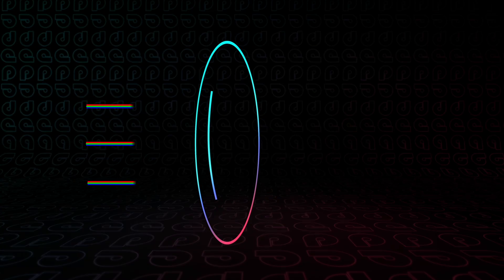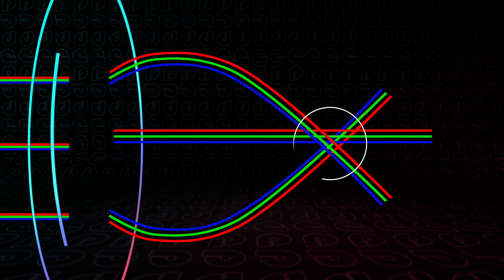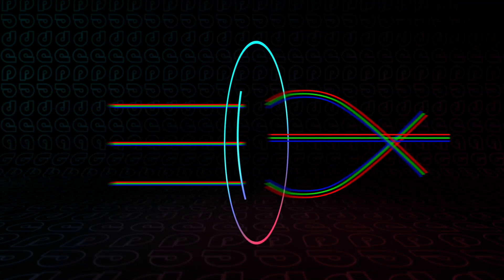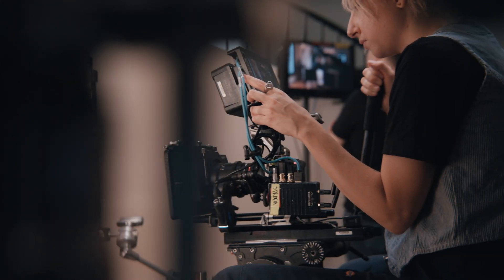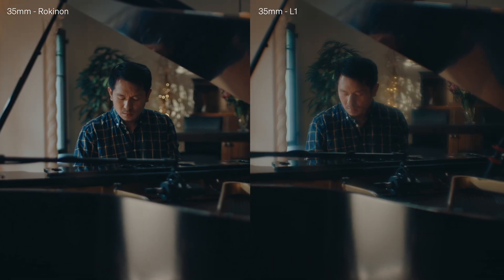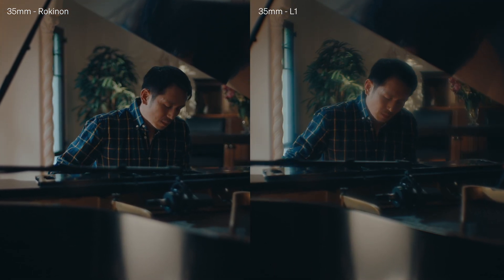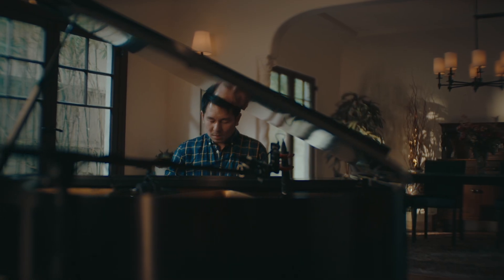And because it's a lens and not a filter, the characteristics are not necessarily unilateral. The optomechanical approach to the tuner is unique — when you roll the dial, it works like a tiny zoom lens, but the cam that drives the zoom doesn't affect the focal length. It repositions the lens to increase or decrease the intensity by adjusting the aberration. When light passes through a lens, the colors are spread out over a wide area. When those rays fail to converge, the flaws in the result are known as lens aberration — images can become blurry, colors can bleed, highlights can halate, focus can be asymmetrical, and images can bow. Control over aberration is what separates lenses that look perfect from lenses that have character.